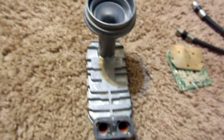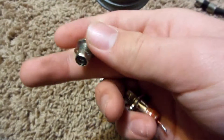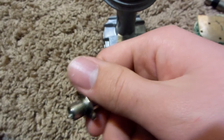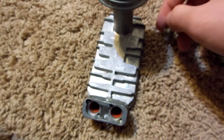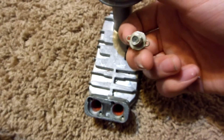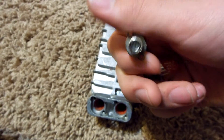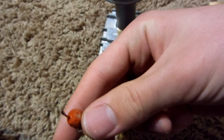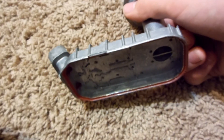Be sure to kind of pull it apart and remove these coaxial cables, because that's what will be holding it to the dish. Be sure to remove the connectors as well — these will be brass or stainless steel, but in my case these were actually brass. These aren't too hard to remove. Once you remove the board, you can go on the front and get yourself some side cutters, just move them back and forth and the insulation will easily separate, and you should be able to get a nice clean piece of cast aluminum.